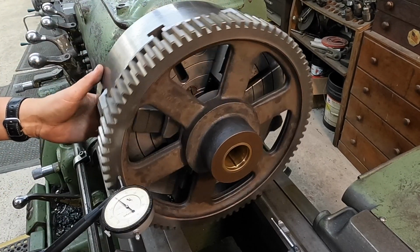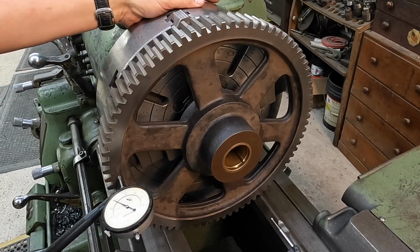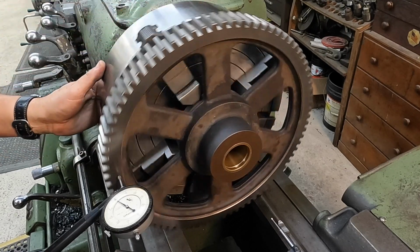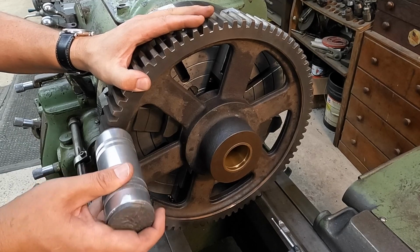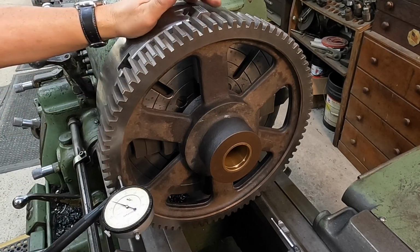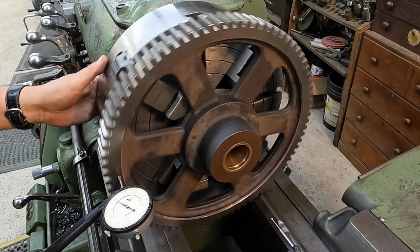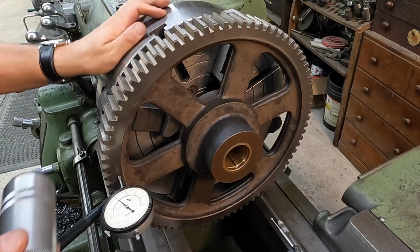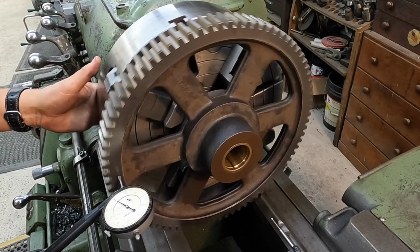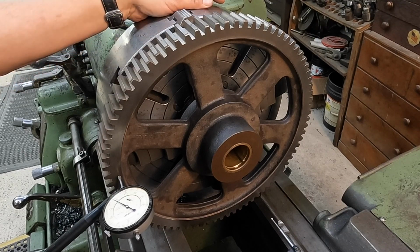And I probably moved it too far. I did. That's based on how tight the jaws are at any given time. We have one jaw that's probably a little more loose than the other two, or the other three. And this just takes some time. You don't hit it exactly every time. You go too far and you have to go back and bump it again. But I like to share this stuff because people are learning this. So right there, we're right where we need to be.